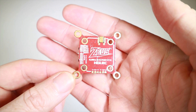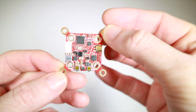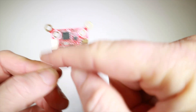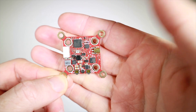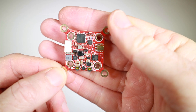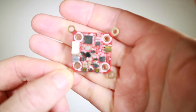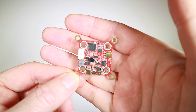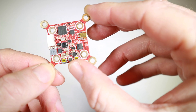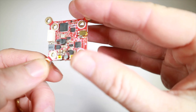Here's the Zeus VTX, and here's the cool thing about it — the mounting holes. These are 30.5mm, your regular full-size stack, but if you've got a three inch — and some people are running this on a five inch now — these holes are 20mm for a 20mm stack. The only thing it doesn't do is the really micro 16mm stack. You've got two buttons here to control it, though almost no one will be doing that now since this thing uses the tramp protocol.